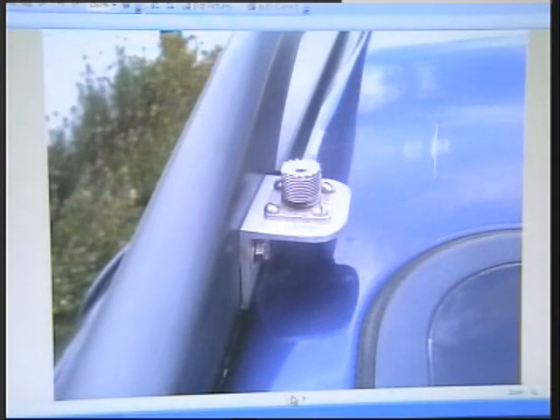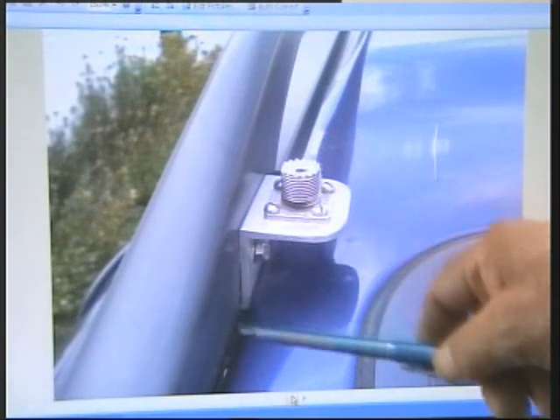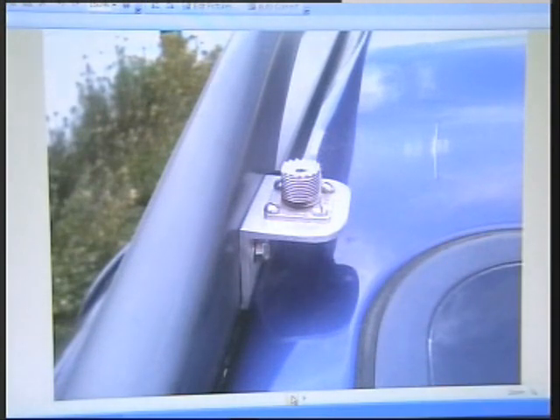It's very neat. The coax — again using Araldite — goes in through the rubbers of the doorway, and I just use UR67, which is plenty good enough for the short run and for 2m vertical polarization. So I thought I'd show you that one. It is extremely simple, but there's some elegance in its simplicity.